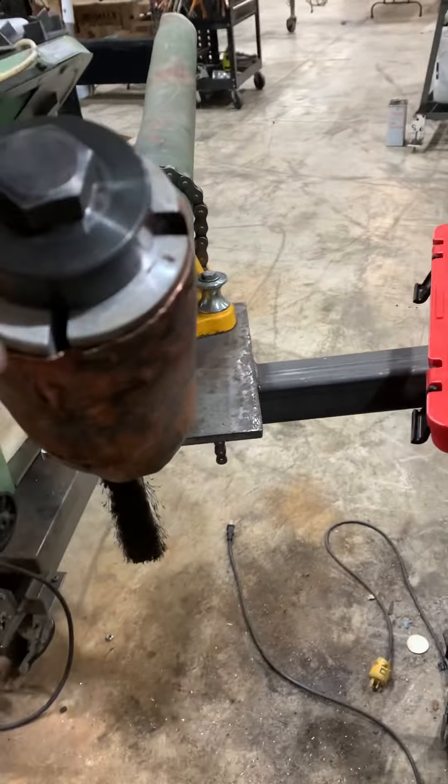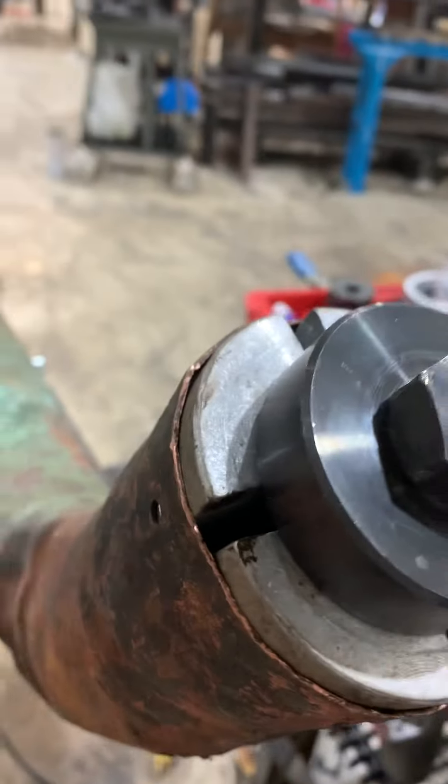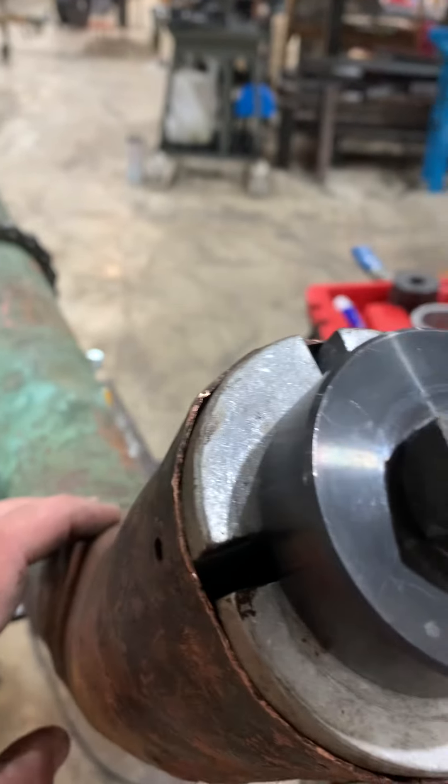We slipped this down in at various places and pounded the copper into shape with a rubber mallet. Like I said, this shape is as good as what's generally found in these boats after 70 years. We're just going to put the expander in the tail end that comes through the transom and expand it back into its correct shape.